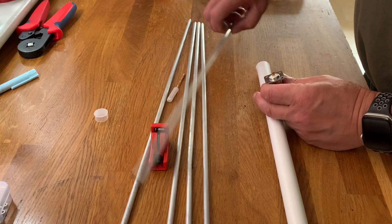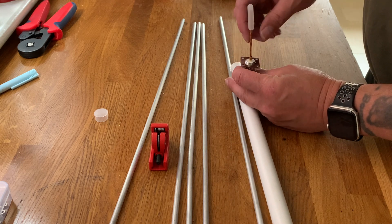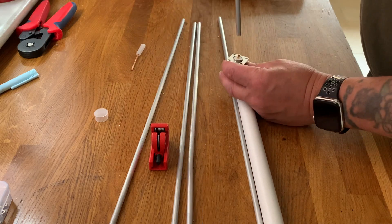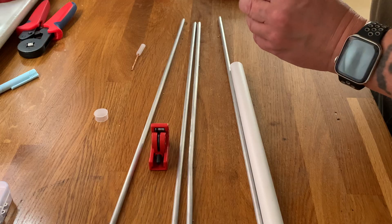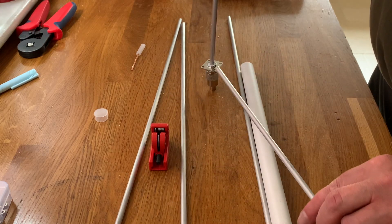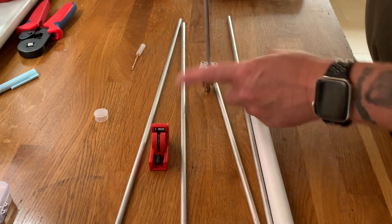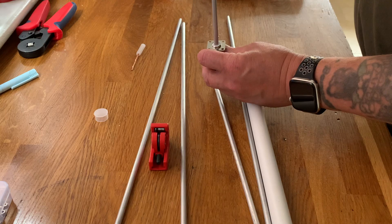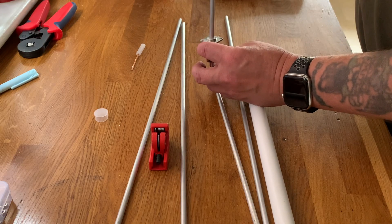What we're going to do is solder the center core from our RG213 coax up like so — I'll snip it about there and peel back the top of it just slightly, and one of these connectors will sit over the top of it. Then I'll glue that in and around. I'm going to put four rods at each side, bent down at 120 degrees to make the customary 120 degree legs, and that should be good for our two meter band.